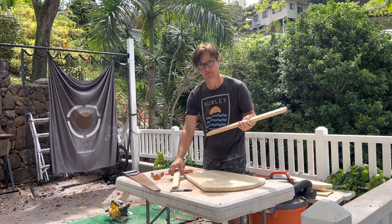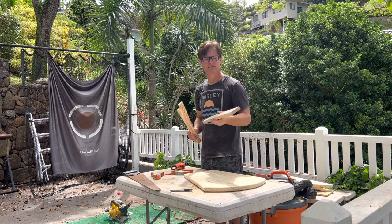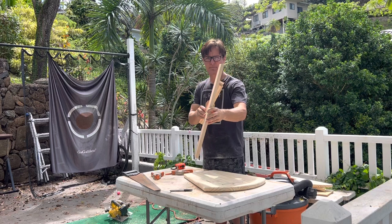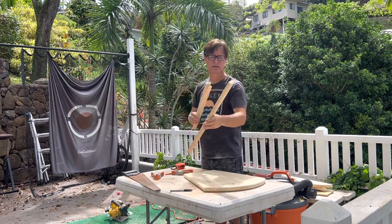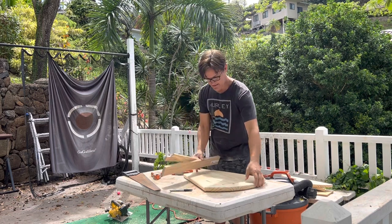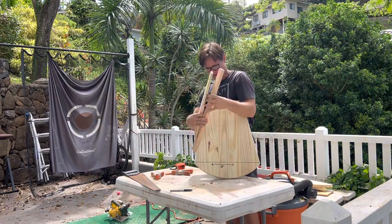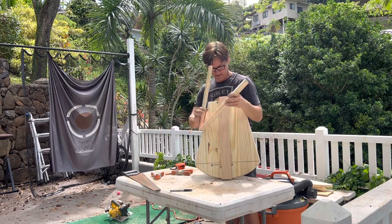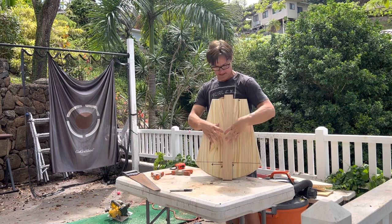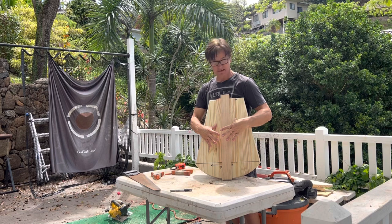And these three things are going to be used to set up the mechanism that slides, so that you can adjust the length of this thing. And also this piece of oak is going to get doubled up at the end to hold the handles in. Now that's going to be the most complicated part, but basically this is kind of going to go down the middle. These two bits on the side are going to create the channel for it to slide in and out of, and there'll be kind of like an adjustable bolt that goes through the thickness of everything. But that's the next step.